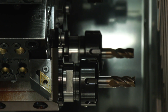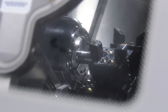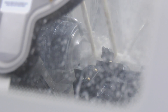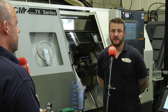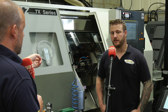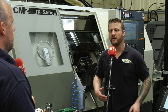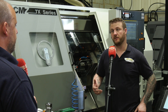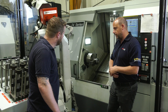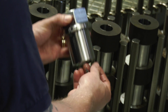The power on the milling, Darren — this is a big factor, because turning is one thing, but if you want to mill as well, how capable are they? Brilliant. These are more powerful than some small VMCs I've had. We do quite heavy machining and you barely know it's doing it — it's so quiet. Have you taken work off the milling machines and incorporated it into your cycles here because this is doing it faster? Yeah. The previous lathes' live tooling was getting weaker and less reliable, so we had to move work onto the milling machines. With these, it's all come straight back and more — in some instances we're doing the milling work quicker on the CMZs than on the VMCs.